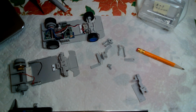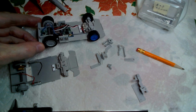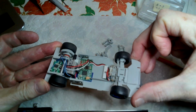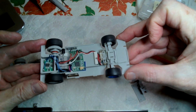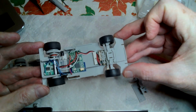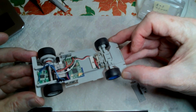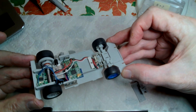Anyway, if you can, I found the rear differential is absolutely required to make the car handle well and turn the same way in both directions. The differential is required. If you can build the differential in the rear, and you can build the front suspension, you pretty much can build the car, because the chassis comes down to just a plate.